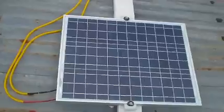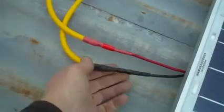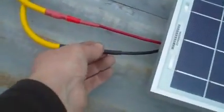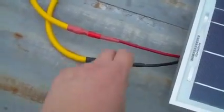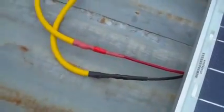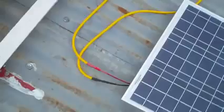These will be the panels that ultimately get the dishwasher off the grid — hopefully this summer. There they are, now leaky-taped up. I personally think this is just as watertight as an MC4, and a much better conductor, because these bullets are about one-and-a-half times the diameter of MC4 pins. You actually get to see the connection and push them right in, so you know they're making a good contact. Once that tape is around it, it'll be waterproof.